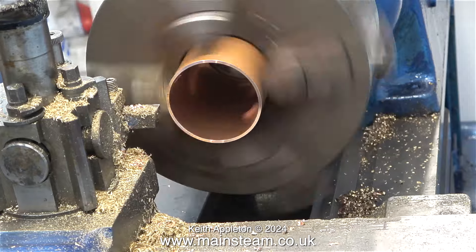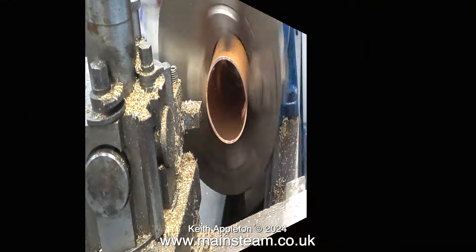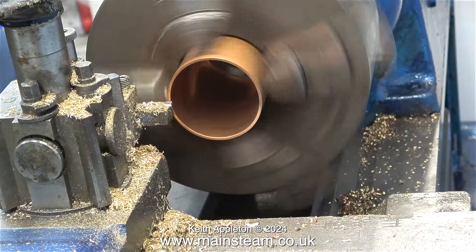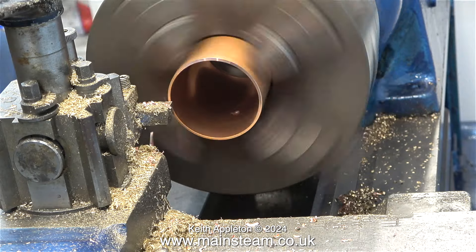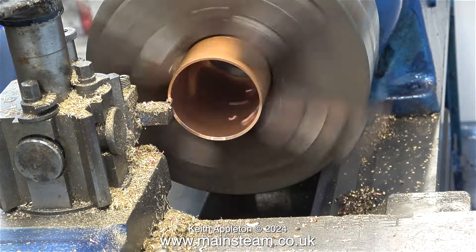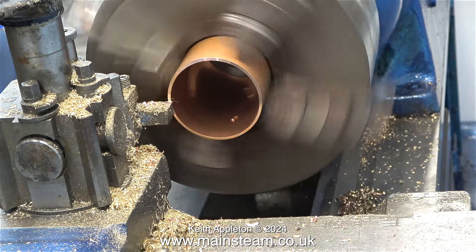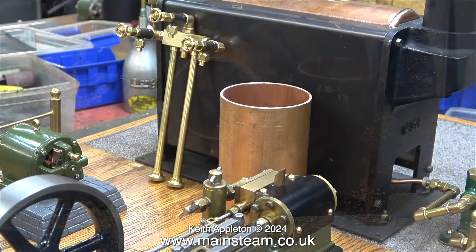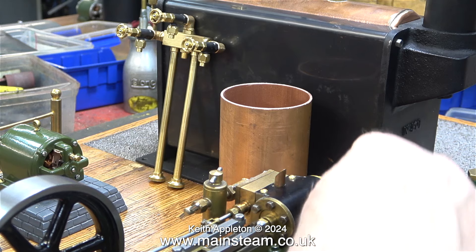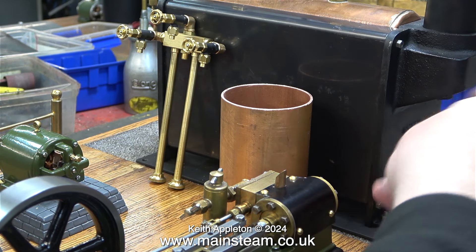What I'm doing in this episode is making the condenser oil trap and deciding where to mount it. The first job is to square up the end. With the Smart and Brown, the entire piece of copper tube goes in the chuck — this job would not be quite so easy if the lathe were smaller. I deburred the inside of the ends of the piece of tube using a deburring tool and the outside using a file.